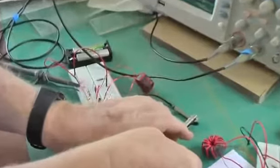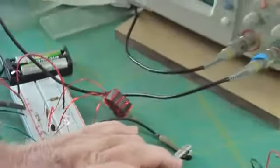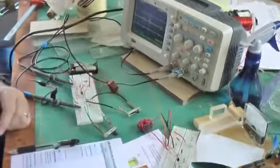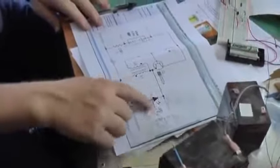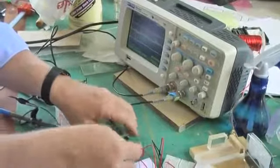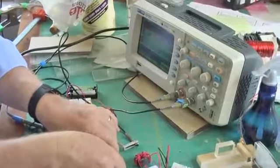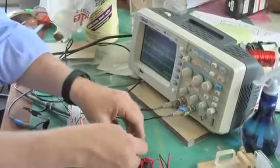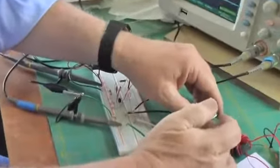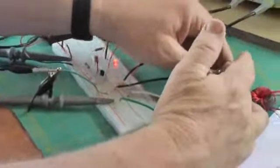That's my idea — we're still putting power through the output leg, but we're limiting the input power. You can also change the amount of power dumped on the output circuit by varying this resistor here. By varying that resistor, we can change the input power. These are the two I play with mainly when trying to tune the circuit. I vary this and you can see the LED changes in brightness. Once I get up here to 10 kilohms at the end, it still glows. Down at the other end it's zero. There's some variation, but not enormous.